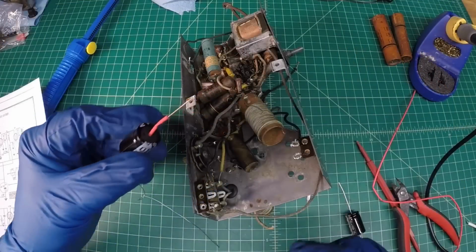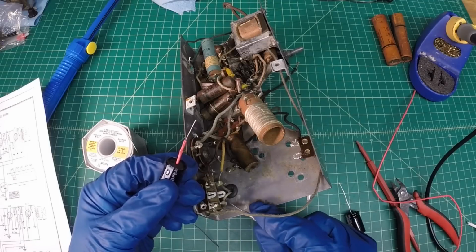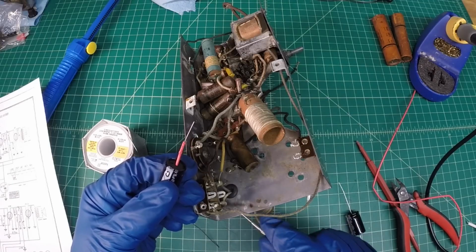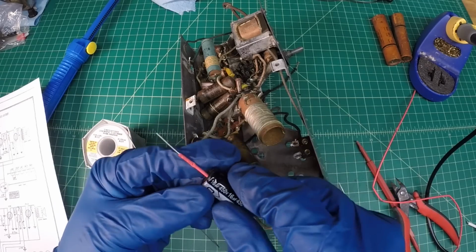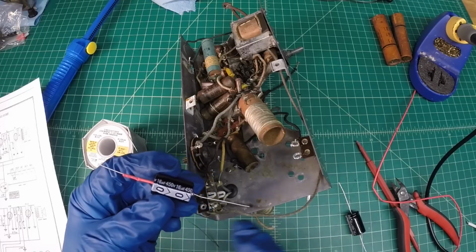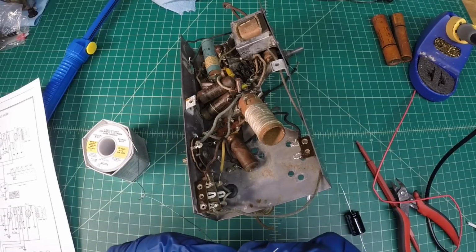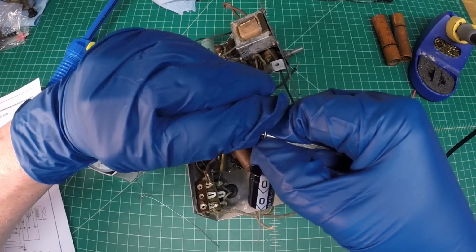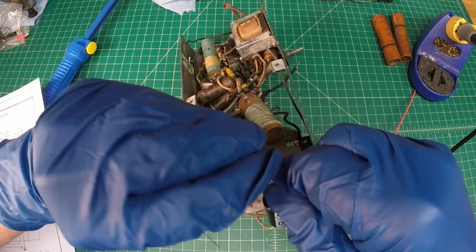Okay, I'm going to use the coil method here for this one connection because this lead actually runs through the terminal strip here on the bottom side, and it's hard to see here on camera. But again, my negative side will go back here toward the terminal strip. So just take a small screwdriver here, and form my coil.